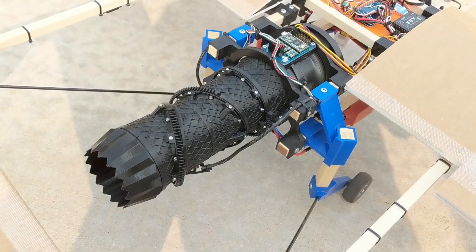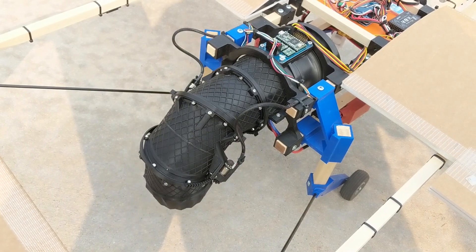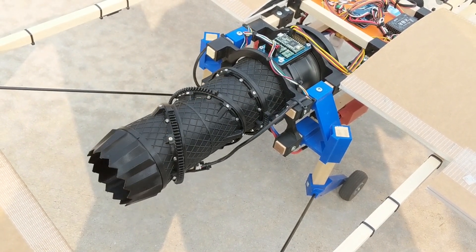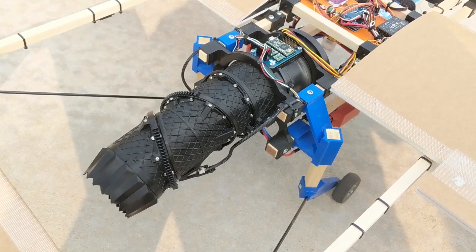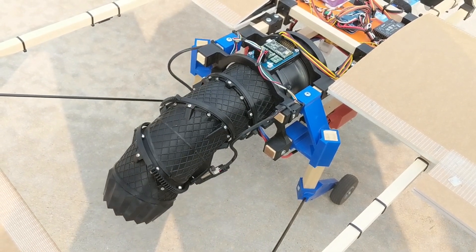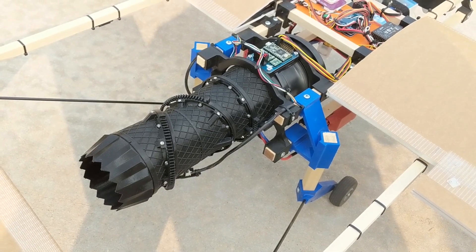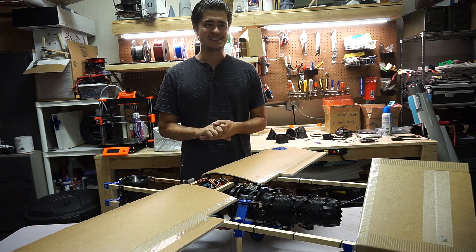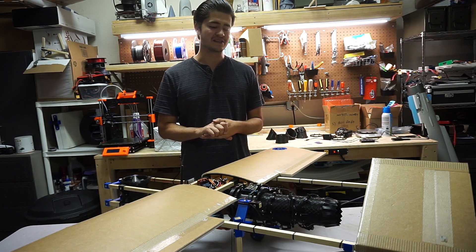Now it's accurate travel. The sweep from zero degrees to the thrust deflected position for vertical flight is non-linear in the motion of the duct sections, but it's linear in the motion of the total thrust vector angle. So we have nice smooth continuous tilt from zero degrees to 90 degrees, or past 90 degrees to 105 if that's what we're working on. A nice big correction to a math mistake that I'm pretty happy to have found and solved.